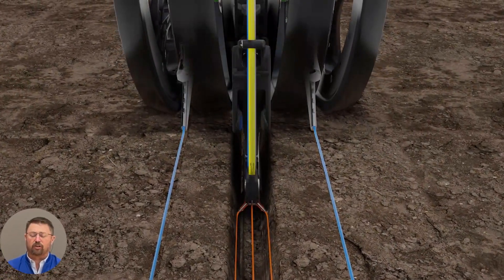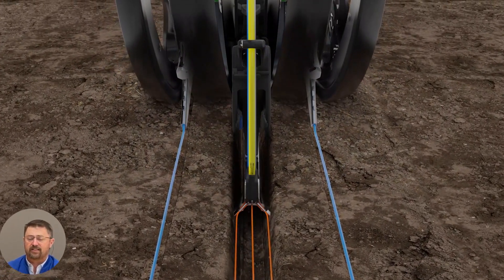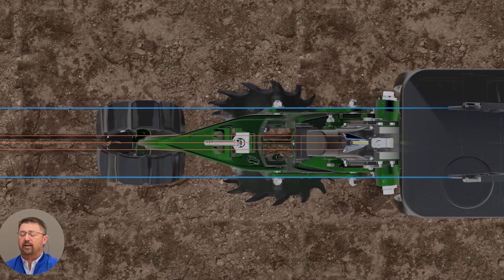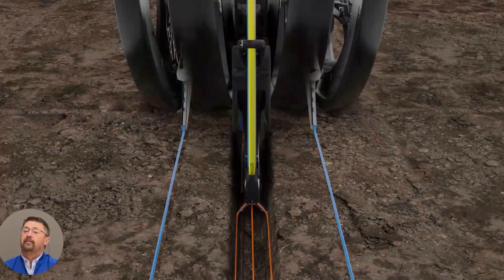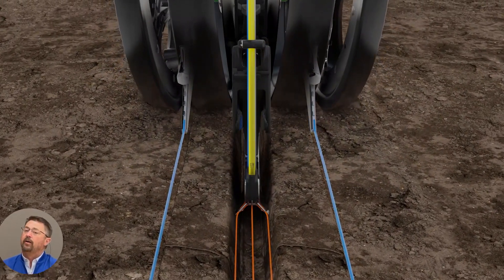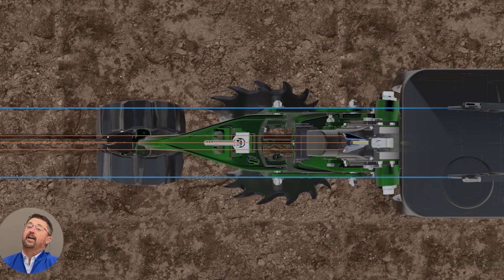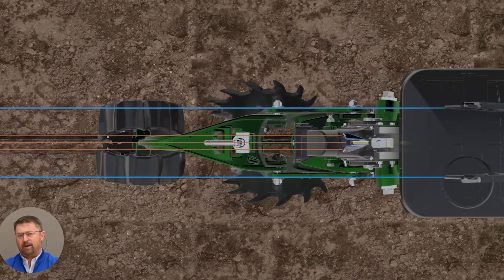Here's that five-point liquid touch. Look at the orange lines — those are my in-furrow applications. Some fertilizer can't go next to the seed, so I'll put it off to the side in FurrowJet wing. Some fertilizers — maybe a sugar, maybe a biological — can go close to the seed to give it a great early start. The blue lines on the outside are my Conceal — products with potentially higher salt value that I can't have near soybeans at all. But once the plant comes up and establishes its root system, after taking advantage of the in-furrow fertilizer, those roots will kick into overdrive when they get access to our concealed band of nutrition.